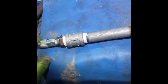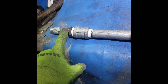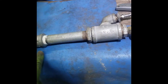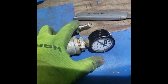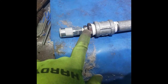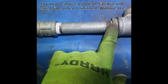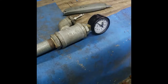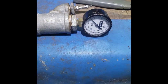So I ended up using this — I showed you the well house in the previous video where I could put the air in. This is another way to do that. I slip this on the end, or you could screw it on, remove a faucet, or put a hose fitting on the bottom end. You go from the gauge all the way down — there's a Schrader valve like you have on a bicycle tire. Depending on what I want to use it for, I can plug it into what I've got set up out there, or screw in a half inch, three-quarter inch, one inch, or inch-and-a-quarter fitting.